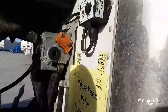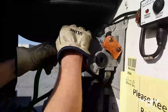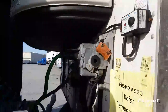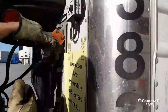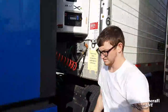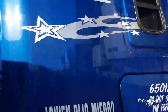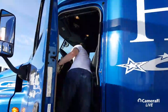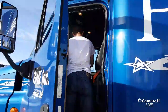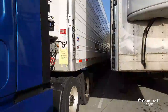And we hook up the electrical line. At this point we want to release the trailer valve — so while you're doing the walk around on the trailer, the air pressure is building up on the trailer. He's not going to crash anything. You release it — all right, after we release it we're going to come over here.